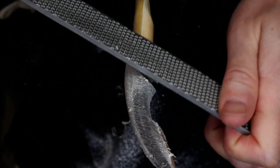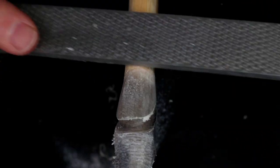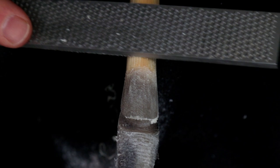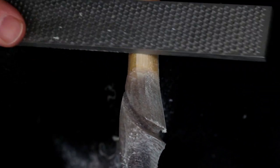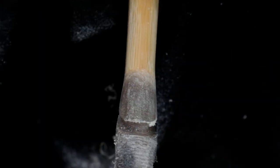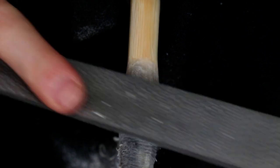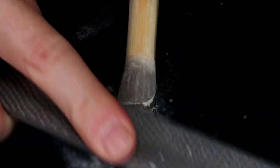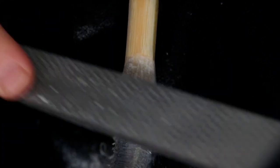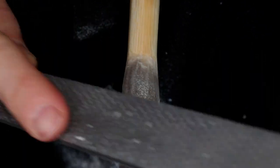A design and function of the top nock that I often see people getting wrong is the socket section, the even continuation from the bow limb into the horn, particularly running from the back of the bow, as this is where the string needs to slide effortlessly along when bracing to get that loop into the groove. Make the change from bow into nock as seamless as possible.